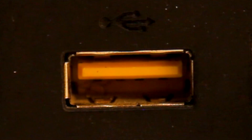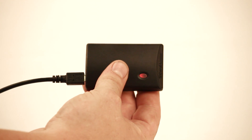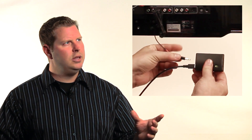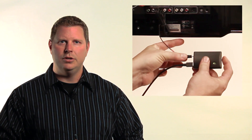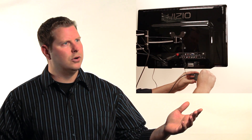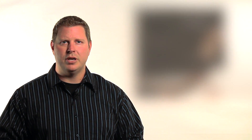The first time you power up the Z2IR, the identification button LED is solid red, meaning it is not connected. Second, plug in the emitter or emitters into the Z2IR's IR ports — remember, they're numbered one and two. Using the supplied Velcro, attach the Z2IR module to the back of the TV. Because it's small, you can place it just about anywhere — just be mindful of the USB and IR emitter wire placement. Finally, attach the IR emitter head over the target device's IR receiver, and now you're ready to install the Z2IR driver and identify it in Composer.